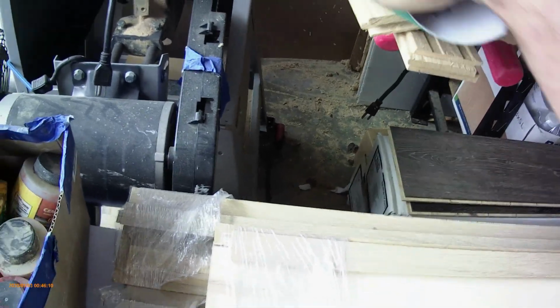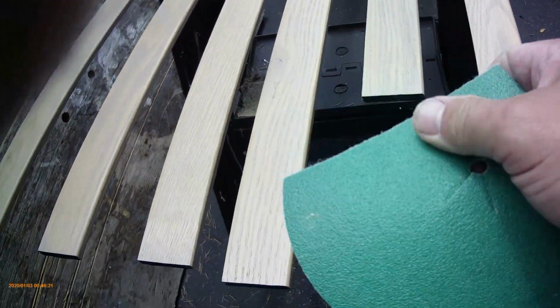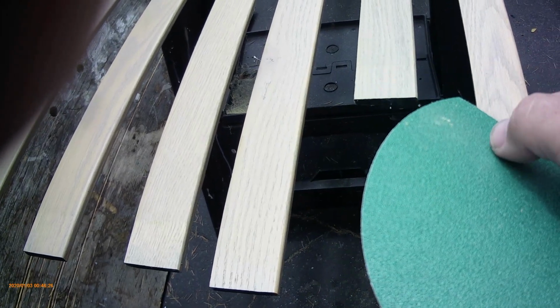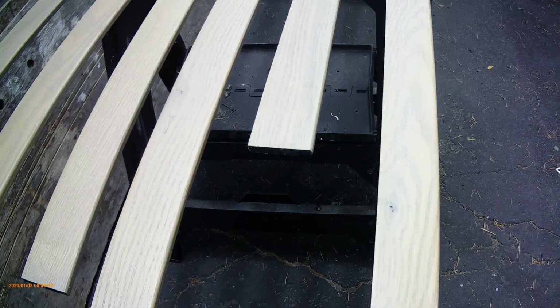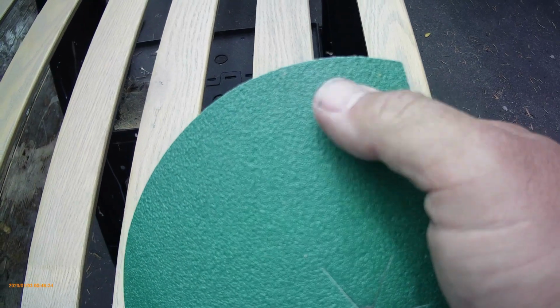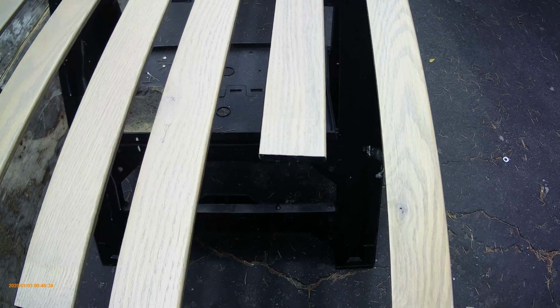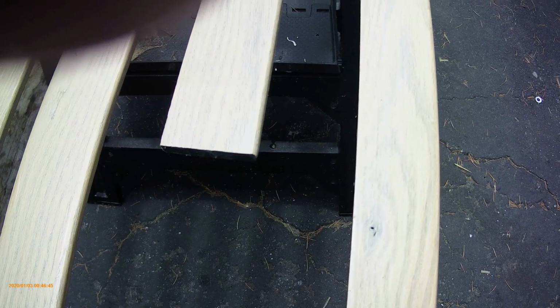So again, it just comes down to working with different products over the years, and if you pay attention, you know what'll work for whatever. And so for this base, it's a ceramic paper. It's expensive, but that ceramic grit just sticks up enough to where it doesn't wear down fast. Those tiny grits are enough to open up that wood, open up that hard grain, and it'll take a little bit of color. So that's the key.